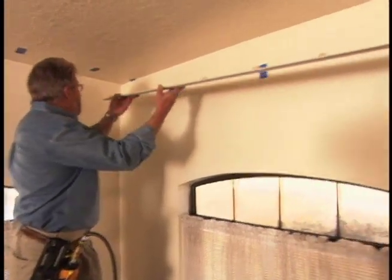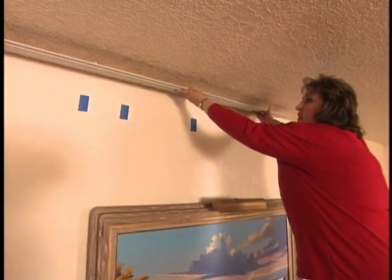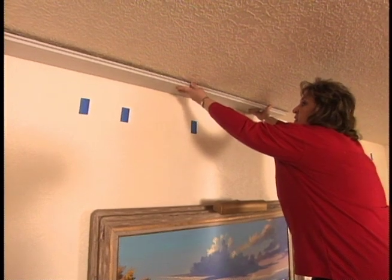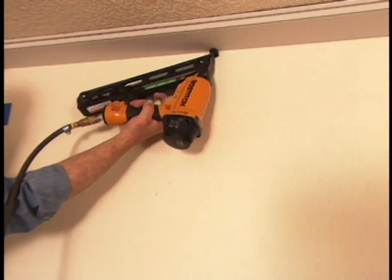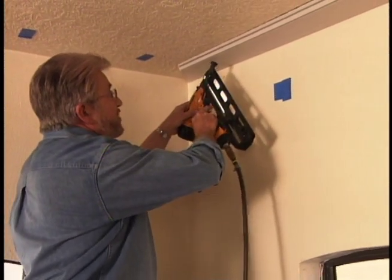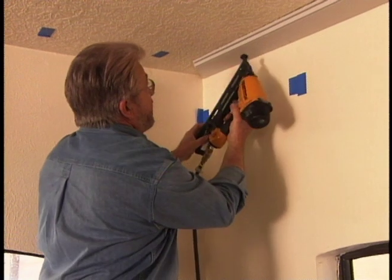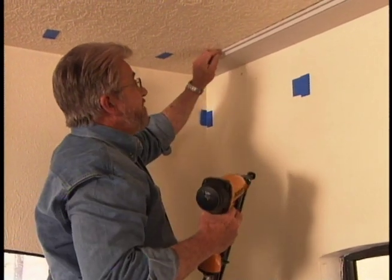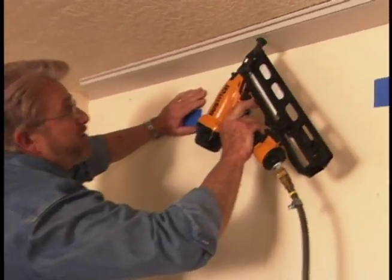Press it all the way up into the wall and up onto the ceiling, like this. Next, I use an air nailer to drive nails into the edge of the joist. Out here, where we've only got the construction adhesive, I'm going to put in two nails at opposing angles — one like this and one like this. That's going to give me a mechanical hold. Not really strong, but strong enough until the glue dries.